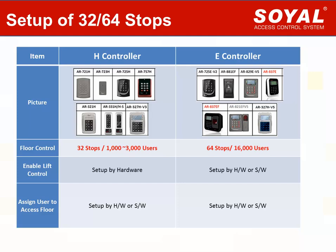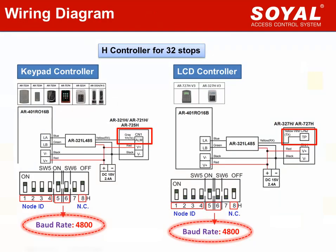After completing hardware selection and learning the lift control structure, we are going to set up lift control. We will separately introduce edge controller and E-controller. There are two steps: Step 1 — Enable controller with lift control function. Step 2 — Assign each user card to accessible floors. Each step can be set up via hardware method or software method. For edge controller with keypad type, we use the gray cable on connector 1 as the lift control signal to connect it with the TTL converter. The default function of the gray cable is alarm output. Once the controller is used for lift control, we modify the parameter to use the same gray cable for lift control signal instead.